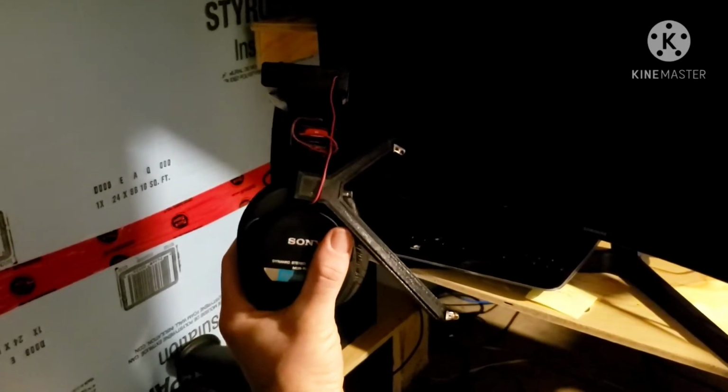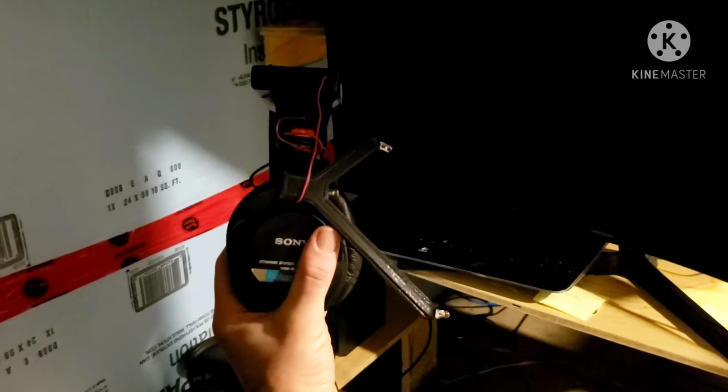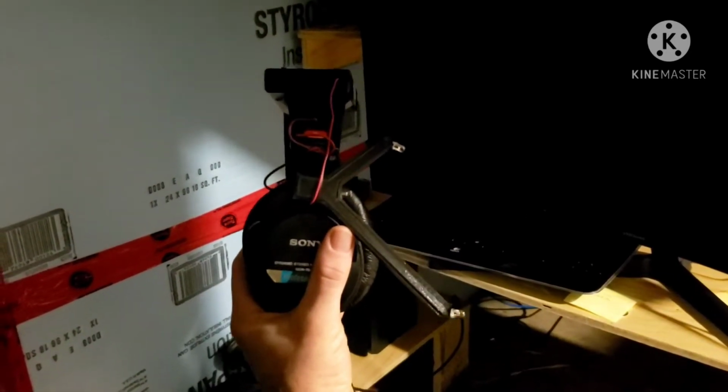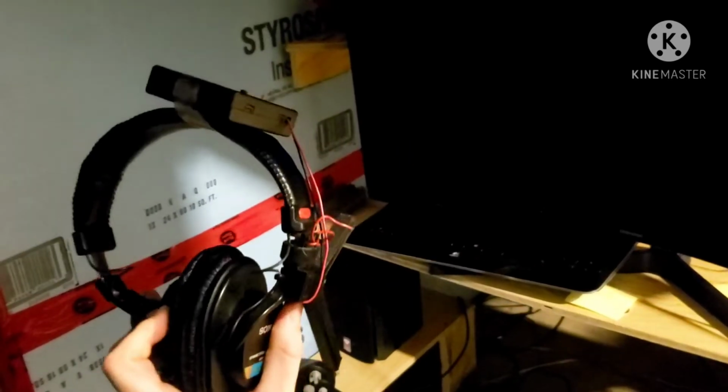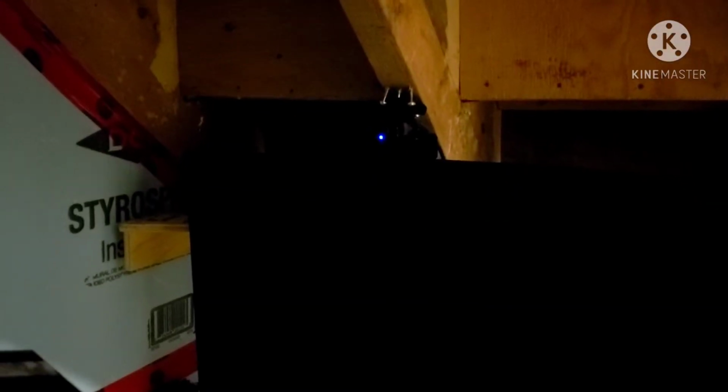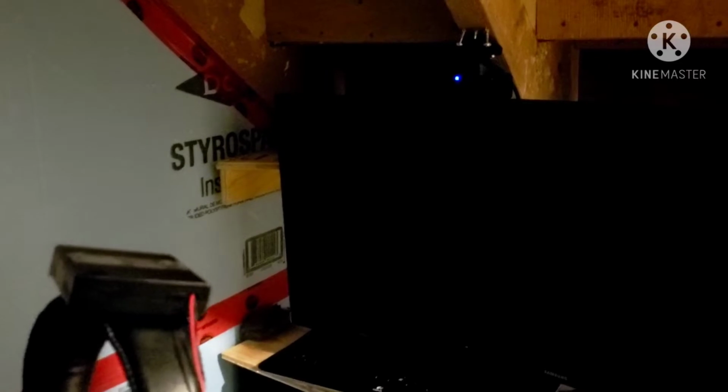And then these got these funny things on the side. This is a homemade head tracking system. So there's 3 infrared LEDs that I put in there. That's a 3D printed piece, and it's got a battery pack that mounts on top. And then over top of the TV, there's an infrared webcam there. And there's a piece of software called OpenTrack that'll pick up those infrared LEDs and give me an option for head control as I'm moving around my head while I'm playing.